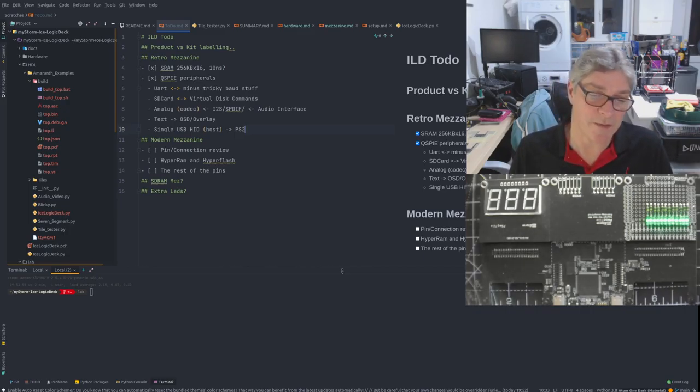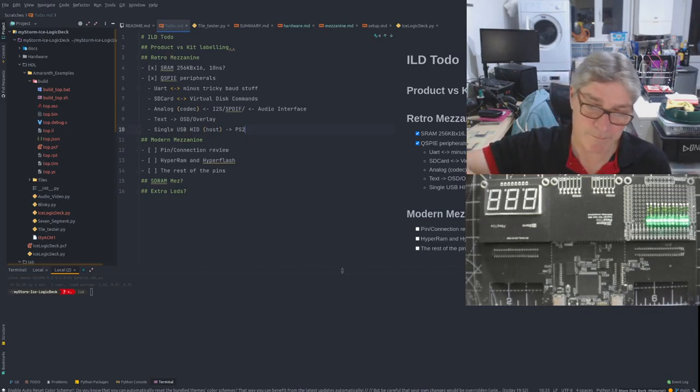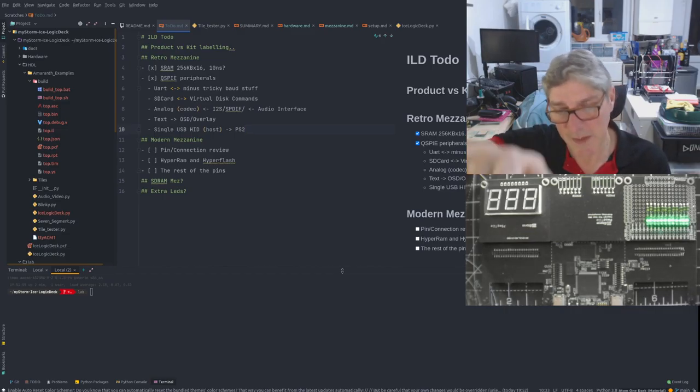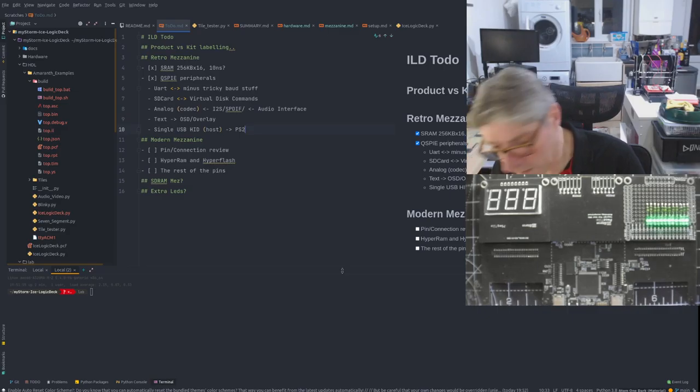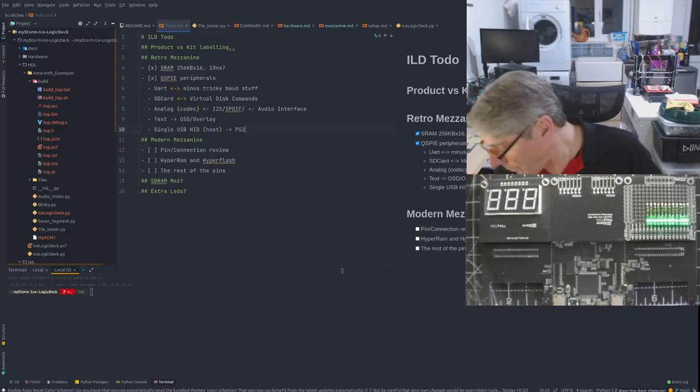So if it was blob tracking, the FPGA could be looking for the color range, drawing a rectangle around where the blob is, then taking just the video information of that blob, including its origin, its XY point, and passing just a small amount of the frame over to the STM32 of interest that it's tracking. The STM32 then successively records the XY position to work out things like motion tracking, if something's moving, or the higher level algorithms.